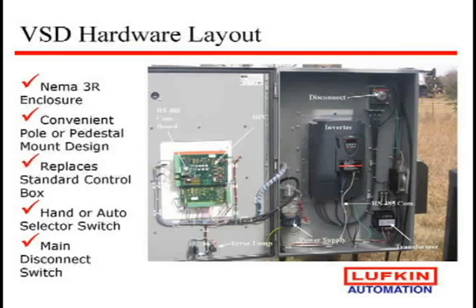So it's truly a variable frequency drive. Some people call them VFDs. Chevron likes to call it an ASD for adjustable speed drive. We've called it variable speed drive just to not get anybody confused about frequencies. One of the things we just want to warn you is a lot of people are taking inverters and throwing them into a regular pump panel. These babies put off a lot of heat, and you need to make sure that you have followed the manufacturer's heat exchange calculations, because you will burn one of these up if they are not vented properly.